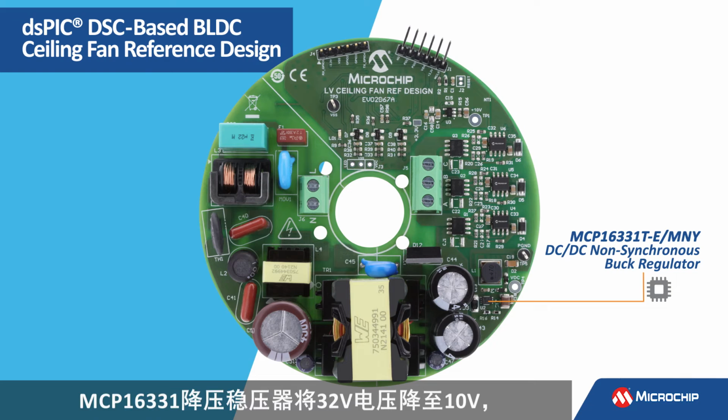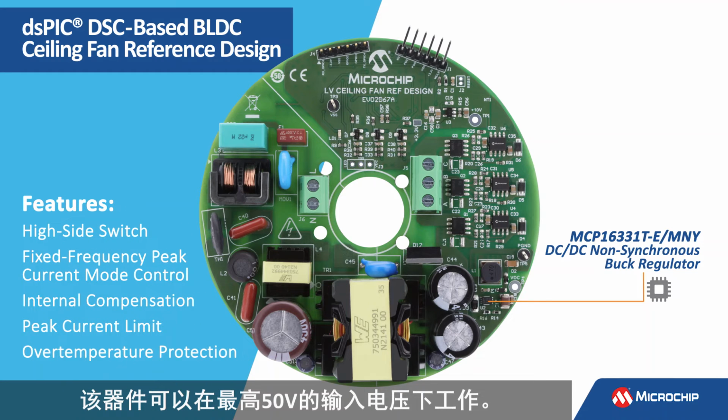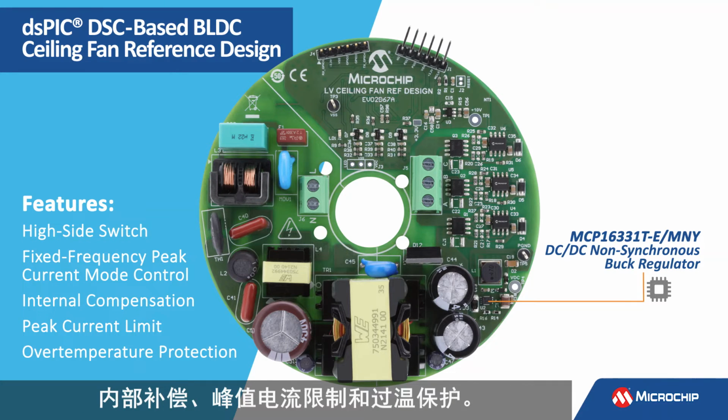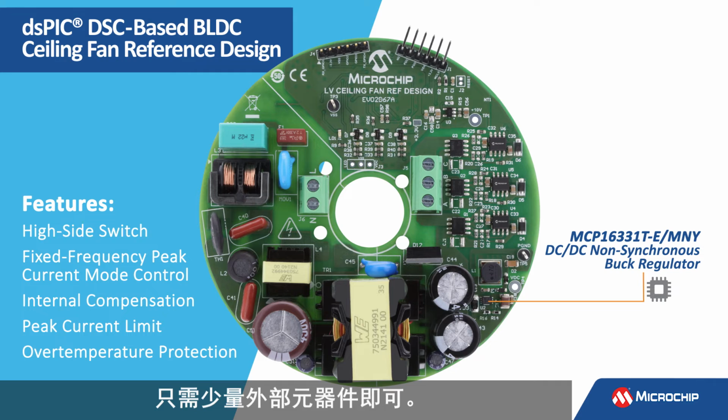The MCP16331 buck regulator drops the 32 volts to 10 volts, which is needed to power the 3 MIC4605 half-bridge MOSFET gate drivers. It operates from input voltage sources up to 50 volts. Integrated features include a high side switch, fixed frequency peak current mode control, internal compensation, peak current limit, and over temperature protection. Minimal external components are needed to develop a complete step-down DC to DC converter power supply.